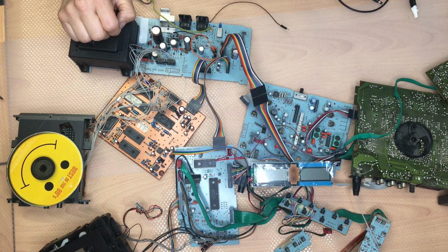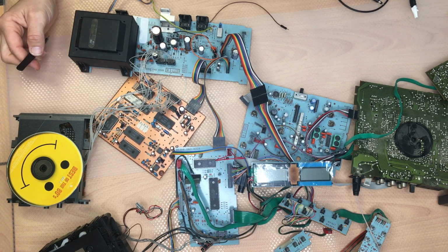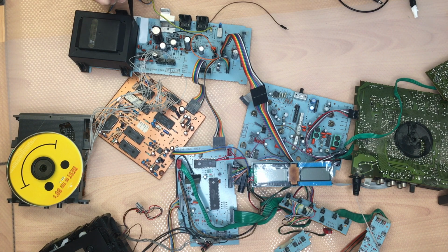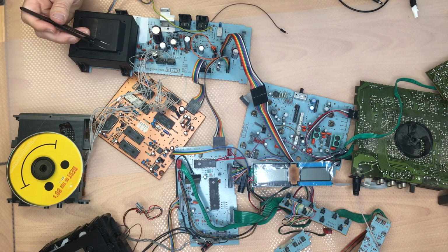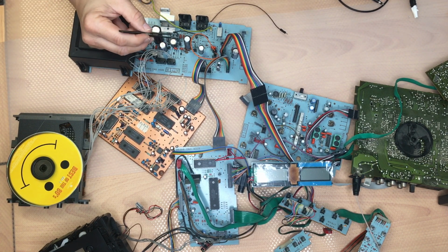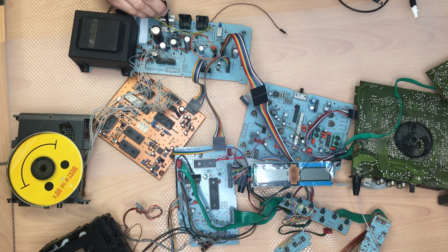That's really good. So as I said, what was broken in unit number 2 was the fuse. So check all the fuses, it is 2. You get a replacement easily. Check all the resistors that are marked with an exclamation mark, since those are fusible resistors, so they can break and then other things are not working.